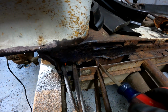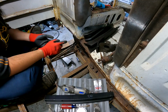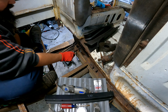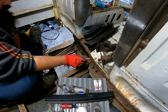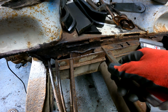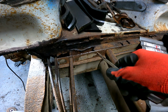I could cut it there and just butt it up, but there's no way that I could weld there and on the bottom. So, my thinking, so I don't have to mess with these pipes, I will take my cutoff wheel, cut the top hat right there, drop my chalk. I've got an idea. I don't know if it's going to be the best way to go about it, but I think it'll be a little more work, but I think it will be the easier, or rather, it'll be a little more welding, but I think it'll be the easier way to do this.